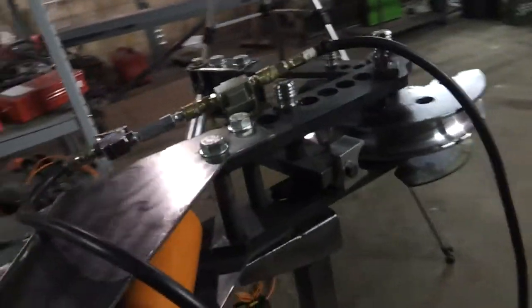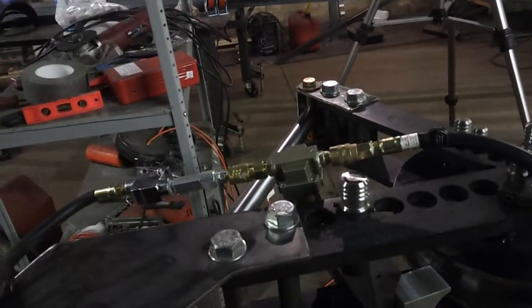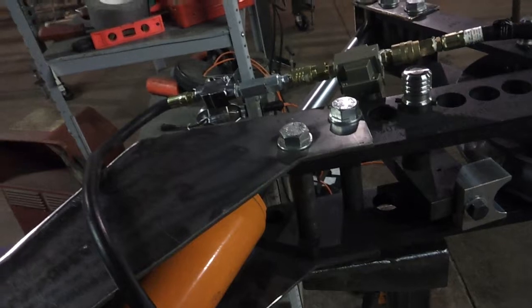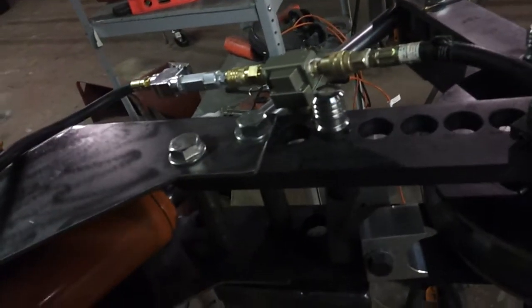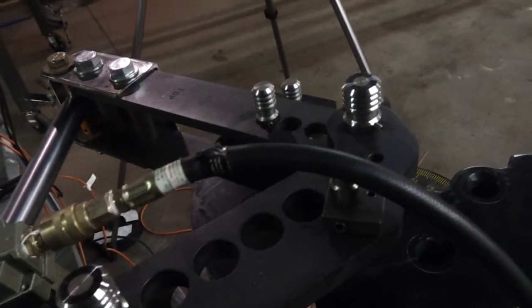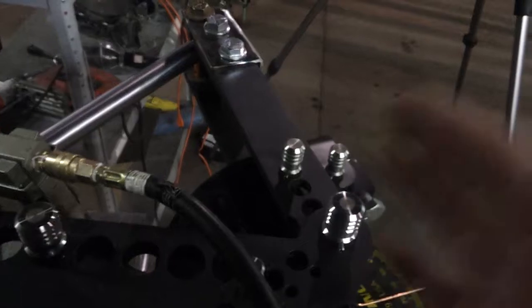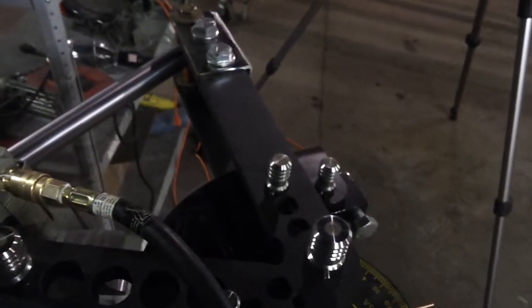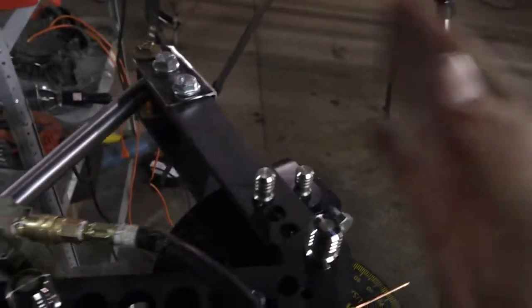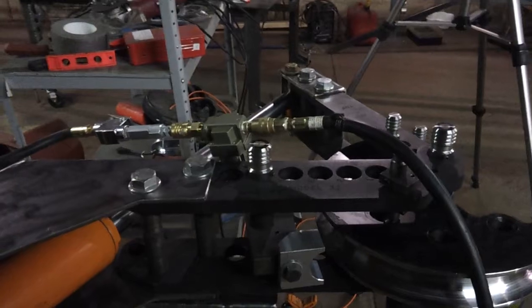Like I said before, I will probably never take it to full extension. The reason why is because anytime you take these jacks all the way to full extension, you're bottoming out the piston and putting excess strain on it. So I'm always going to go to this re-pin point. Even if I'm trying to do a 45 and it's not quite 45 — when you're doing these bends you always need to take a pass. If you're trying to do a 45, you should take it to like 47 or even 48 degrees on the dial, because you have to compensate for some springback once you release the pressure. So I'm never going to take it to full extension.